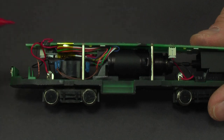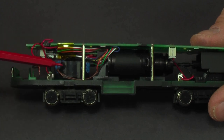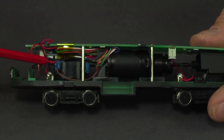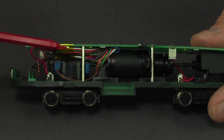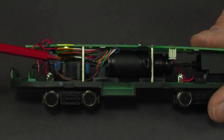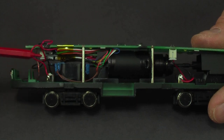So I've installed everything. I've got my decoder up here — I put a little piece of Kapton tape to hold it there and there's just enough room. I didn't have to alter the speaker enclosure at all — it fit right in. I glued it with some silicone adhesive on the bottom, and used a little blue RTV to seal up the speaker in the enclosure, just to make sure it has a nice tight seal. The thing about speaker enclosures is you want to keep the air pressure behind the speaker from mixing with the air pressure in front of the speaker — you want one side to be open and the other closed for the best sound. The only thing I had to solder was two wires onto the speaker itself, which wasn't really a big deal.